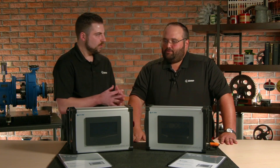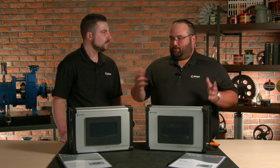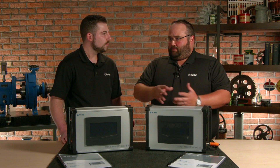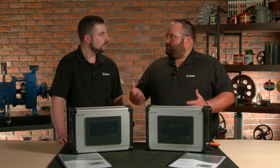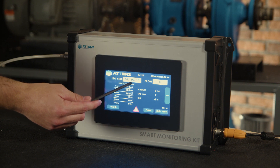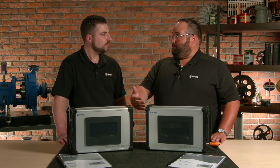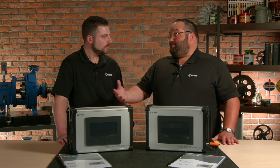What kind of data does it track? One of the leading causes of machine failure is contamination, and the gold standard that most people rely on is the particle count. They send it to a lab, the lab uses an optical particle counter, and it comes back with numbers telling you how many solid particles are in your oil. But there are weaknesses to that — it gets interferences from air bubbles, from water, from additives, and it doesn't really tell you what those particles are. With the sensors inside this kit, it can start to remove some of those interferences, but also identify wear particles. It segments those out and says how much metal is present, here are the wear particles, here's the shape of them — it helps you really diagnose what may be going on inside your equipment.